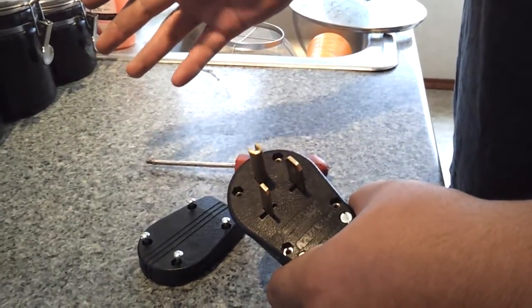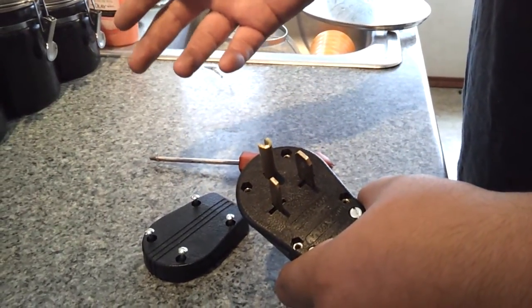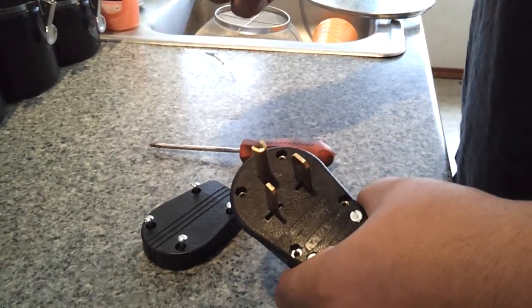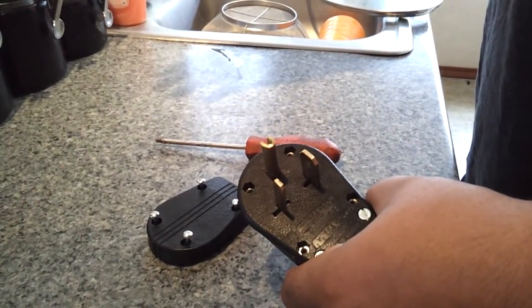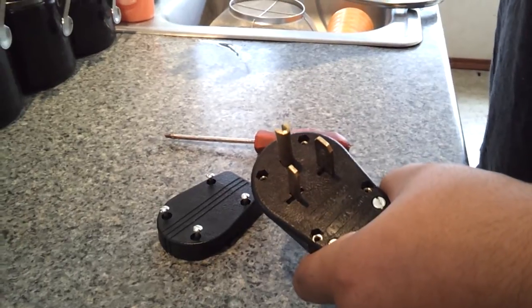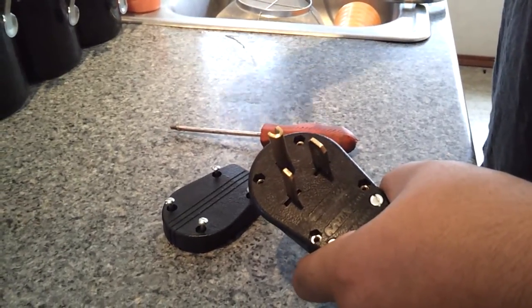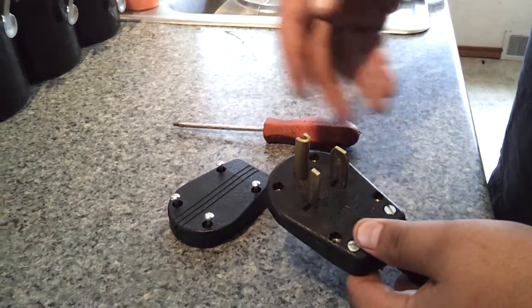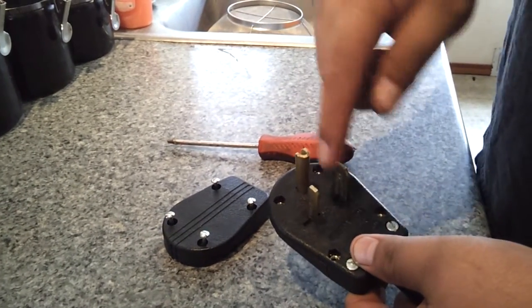You can set this up for a 30 amp. This particular welder is only going to run about 30 amp with the 220 volt. But why do that? If you're going to put in an outlet, you might as well run for the 50 amp. It's not going to hurt the welder. It's just going to allow you to plug things in that are 50 amp or 40 amp or whatever. So run it like this.